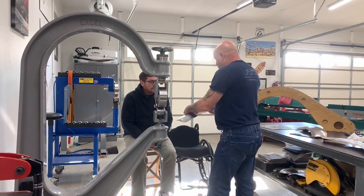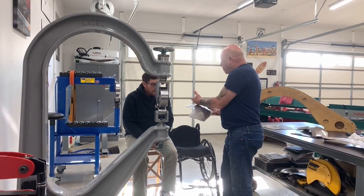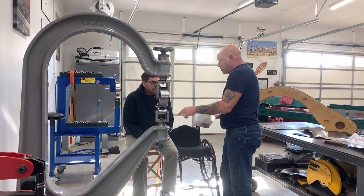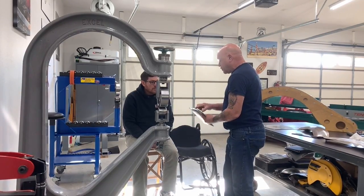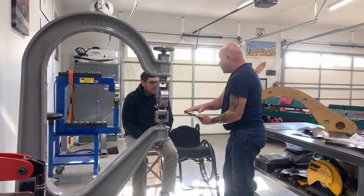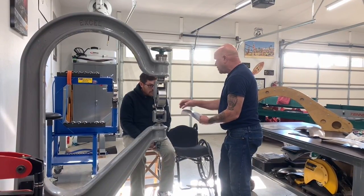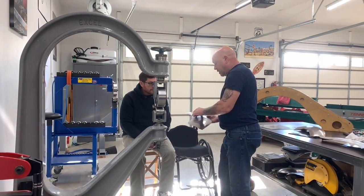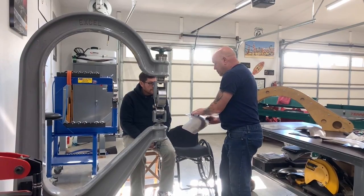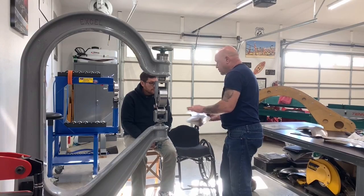So now we've taken care of all the walnuts where we stretched everything up. We ironed it out with the flat top wheel to get it more consistent. We then took care of the waffled edge on the top by wheeling a little closer and doing a very, very light shrink. We then changed to a wider flat top, and we're now in this section here, putting more shape in and taking care of a lot of the big waffle. So now this is a relaxed panel.